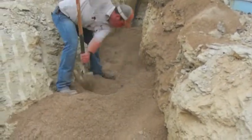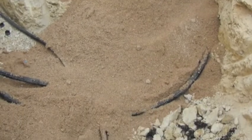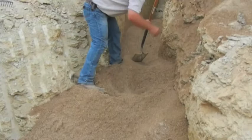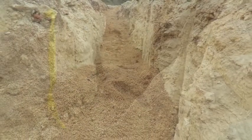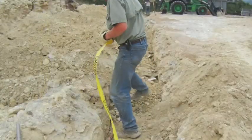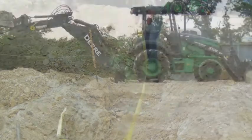Using a small diameter gravel or sand, we bed all the pipe in a soft protective layer with all the large, sharp rocks removed that might harm the loop. About a foot or two from the surface, while backfilling the trench, we lay out a line of copper tracer wire and a brightly colored caution tape that will alert anyone digging in the area that there is pipe buried below.